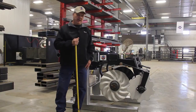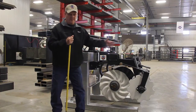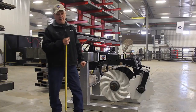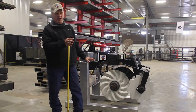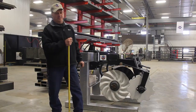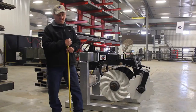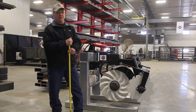Another gentleman and I came up with a design that we could actually swivel these units left to right, which would help tremendously with the drag hose system that is mounted to the tractor, allowing us to turn at the ends without lifting the unit out of the ground. On a pull-type drag hose system, we wouldn't have to run the swivels — we can just turn with it in the ground.